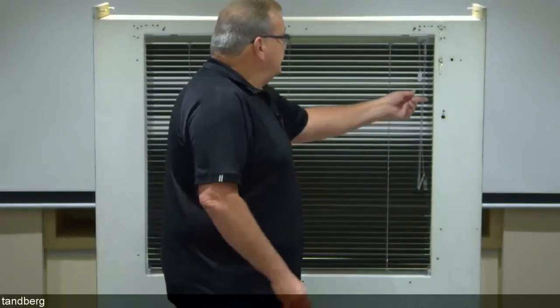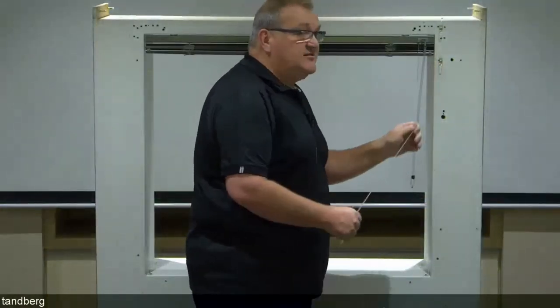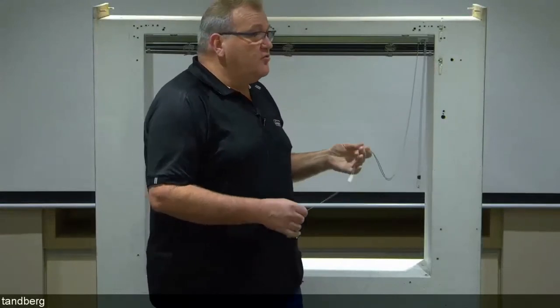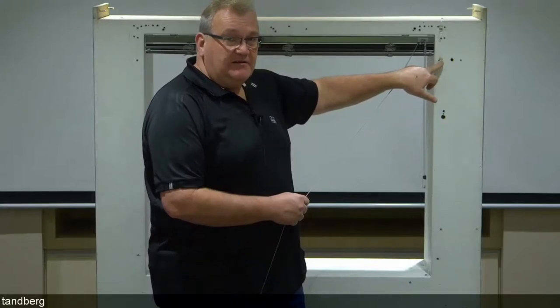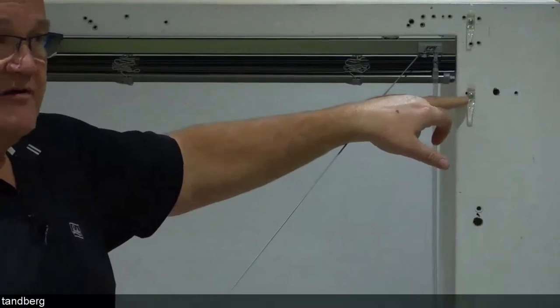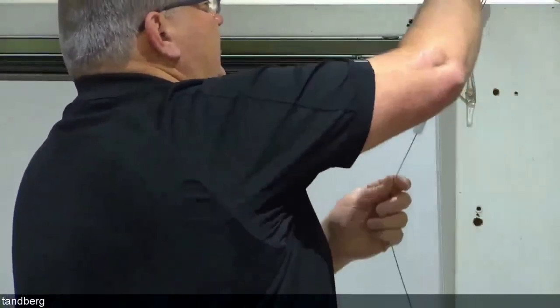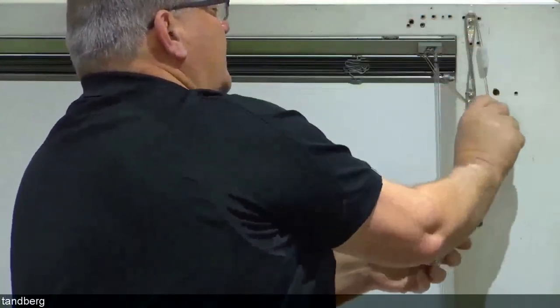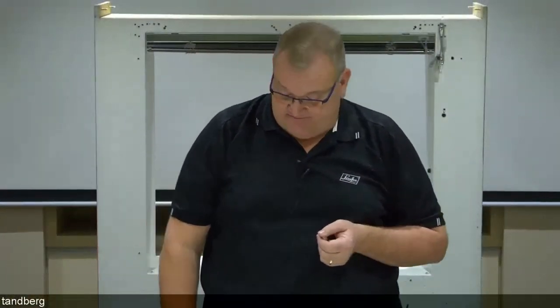Okay. So that's our slimline product. Now, obviously, cords are always an issue with internal window coverings and with Venetians. When you raise a Venetian, you will have a long cord. So cleats must be fitted. Cleats must be fitted. This bottom cleat here must be 1600 off the floor. So this is a critical point. We need to have cleats so the cords can be tied off, getting them out of harm's way of children, and then obviously that adheres to the child safety legislation.